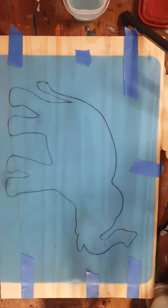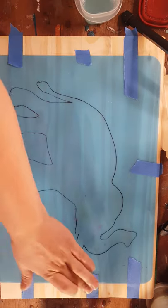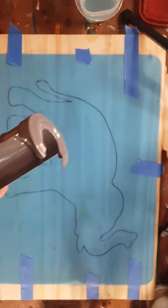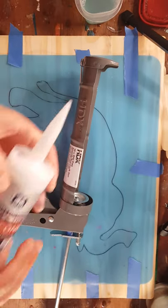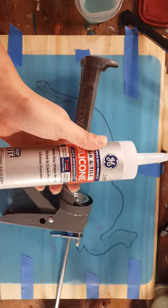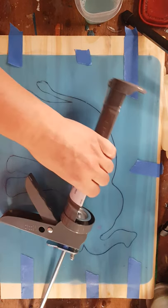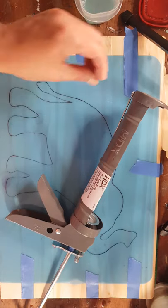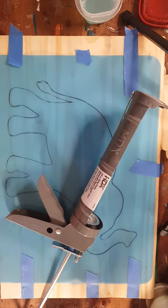I have a little cup of soapy water - it's just Dawn dish soap and water, hopefully I don't have too much soap in it. This is just your standard caulk gun, this one's a Home Depot one. And I have a tube of silicone - it has to say 100% silicone. I went with clear. I want a fairly wide bead, but for filling in tight areas I may need a thinner bead or I'll have to pour some out and hand shape it. That's where the soapy water comes in - you get your fingers damp and you can smooth and shape.